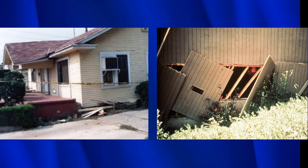You'd step up into the front door of the house. Now, as you can see right here, the floor is a few feet below the landing. So there's the top of the landing, and then the actual floor is right here. So it dropped down, I don't know, maybe a foot or two. And the reason it did that is because there was a wall right here. That was the cripple wall. And when the cripple wall collapsed, the house sunk down this 1 foot or so.